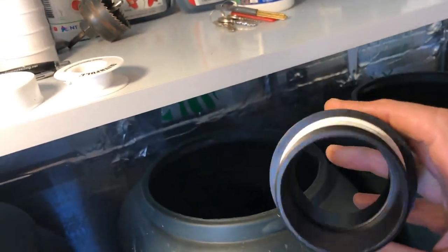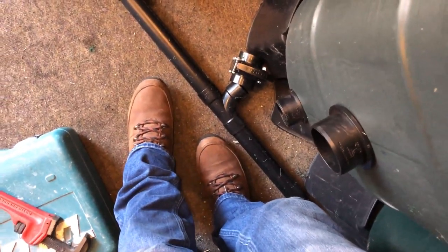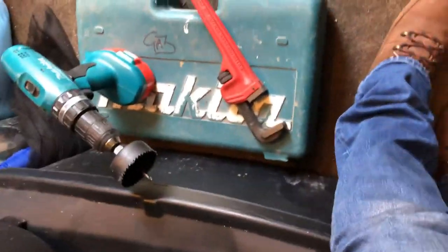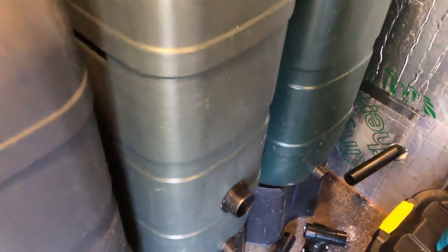And what I've done, PTFE tape. Plenty of PTFE tape, so you can see the amount, a nice good thick line of it. And then if you look, when it goes in, it won't just go straight in, it needs to be wound in, so give it a little turn in, nut on the back. Hopefully I can reach this. Nut on the back, and then the little grips there, hold it on the outside and nip it up nice and tight. So bear with me one second, because I need both hands to do that, and I'll show you when we're done. So there you go, you can see it on the inside there. That's going to be the flow in.